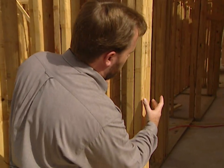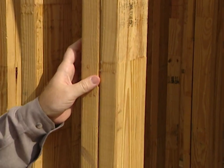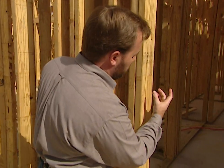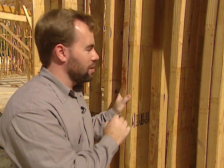On our exterior wall studs, these are two-by-six studs from Georgia Pacific — again southern yellow pine. We didn't go with the two-by-four for a few different reasons. One, we have a lot of weight on this house and need a lot of strength; two-by-six is fifty percent thicker than a two-by-four and about forty percent stronger. We also want really low utility bills. This wall being fifty percent thicker means instead of R13 insulation we can do R19 — the higher the number the more insulated it is, which means lower utility bills.